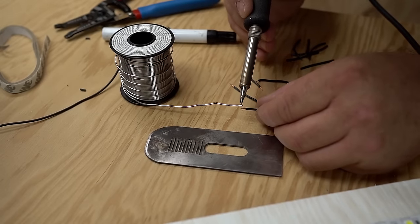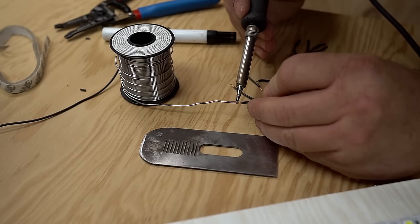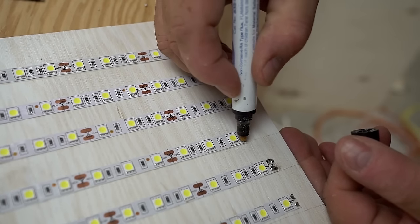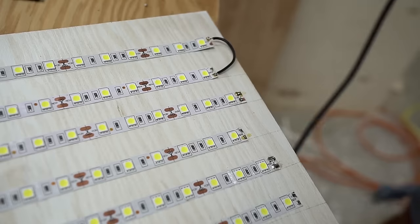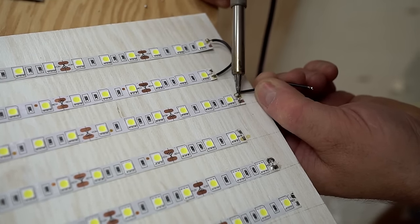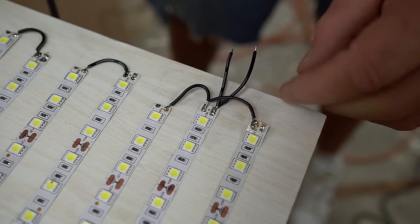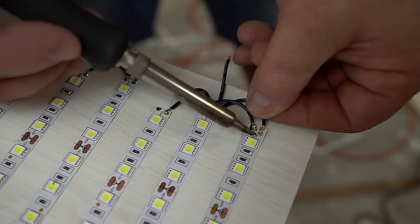To connect the strips together, I cut short pieces of stranded wire, and then I stripped off the insulation and tinned the ends. Here I'm using a flux pen to make the solder flow better while I'm attaching the leads. I've done a lot of soldering and find this to be the easiest way to work. I have the iron in one hand with some solder on the tip and the wire that I want to attach in the other. It didn't take that long to hook it all up,